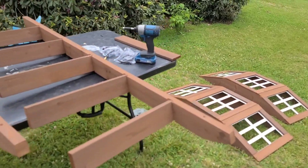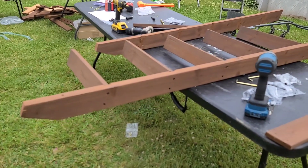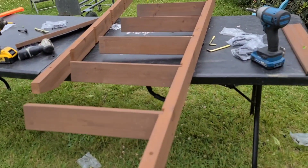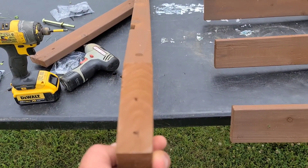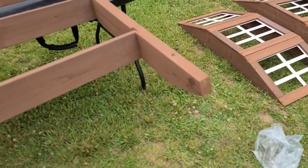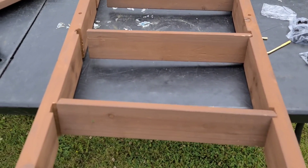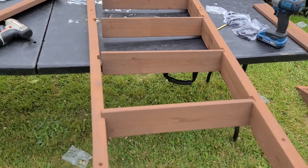Here's your ladder. Take two-inch black screws and put them in through there. One side is done - the main thing is there's a little slant, so make sure they are facing down on both boards. They'll be facing down after you put one side on. Match your side up, attach it, and then we'll put the handles on.